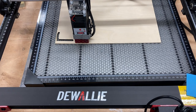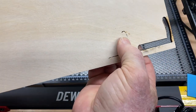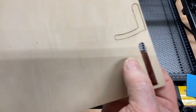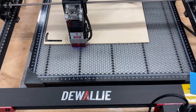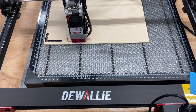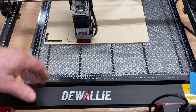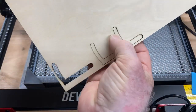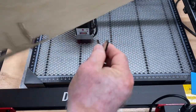It's all done. Let me grab the plywood and see if this little pin will drop out. With the two passes and that plywood raising up, it didn't quite cut out — and that is one more reason why having these little hold-down pins is so important. I decided to change it to three passes, keeping everything else the same: five inches per minute, 127 millimeters per minute, at 100% power. This one is actually much better and will just push right out. I'll put it in the honeycomb and it holds very well.